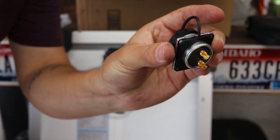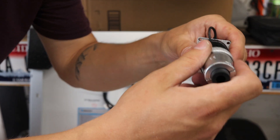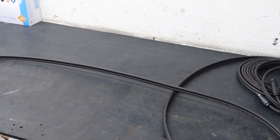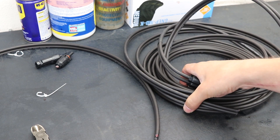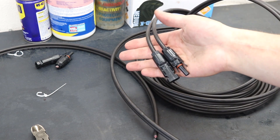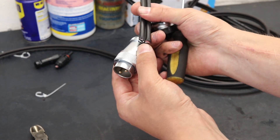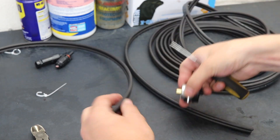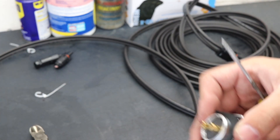This basically goes onto the body of the van. This is going to be attached to that extension cable. First thing I'm going to do is measure out and cut a section of wire that'll go from the bulkhead connector to the battery charger. So this is the extension cable that runs from the van exterior to the panel itself. These connectors connect to the back of the panel, the end goes through this plug, which connects through the van body, and then the other end goes from the bulkhead connector to my charge controller.